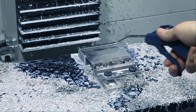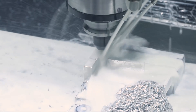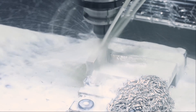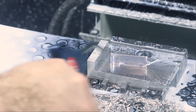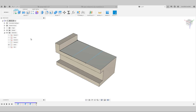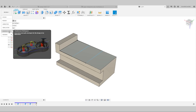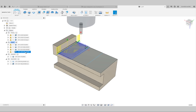The next example we have is clearing material up to a shelf. Normally when the bottom of your shelf face is rectangular like this, it will leave you with a sliver of material intersecting the shelf wall. So if we jump back into Fusion and draw some containment geometry to break that rectangular area down into squares and rough those away in sequence, it will rough away cleanly with no slivers left behind.